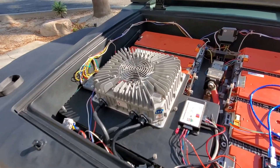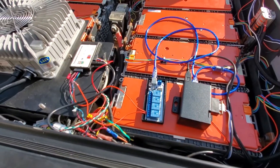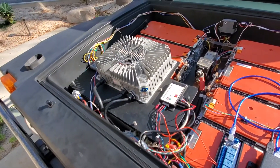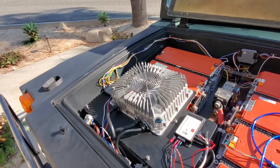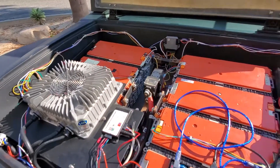You see now it did fail to charge. I don't know why — I need a display up here to find out. If I unplug it and plug it back in... it's usually because this relay here isn't really supposed to be a relay. It's supposed to be an opto-isolator or something with much less resistance than a relay, so this thing thinks it's open.